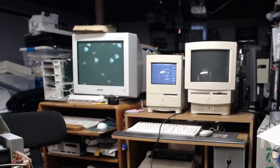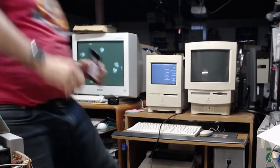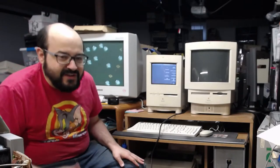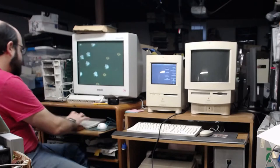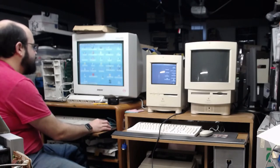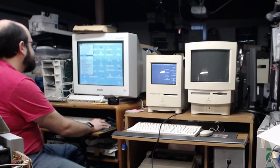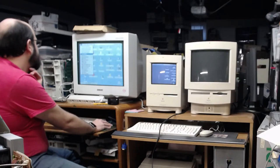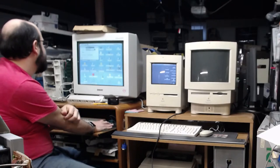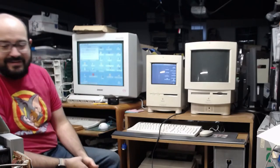Ah, 7600. Yeah, I mean, it would help. But in all honesty, and this is just my opinion, the money you would spend on a G3 upgrade card for a Power Macintosh like a 7600 is probably better spent on a G3 desktop or a G3 tower. You'll have a faster bus speed, faster I/O, faster connectivity, faster everything. That's just my opinion here. Because you're still dealing with the slower bus and the slower I/O of everything else on the 7600, if that's what you're talking about. If I'm just reading the chat too quickly, sorry.